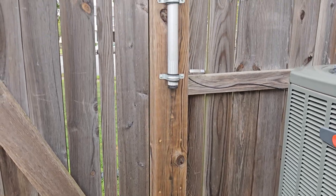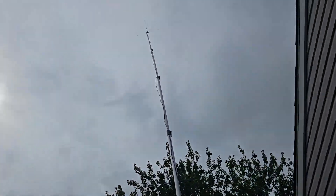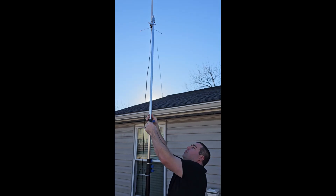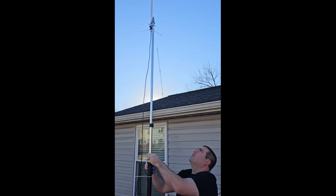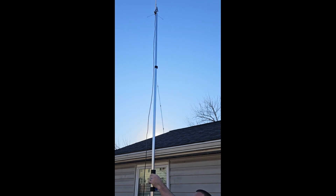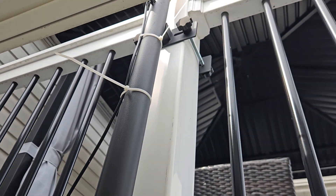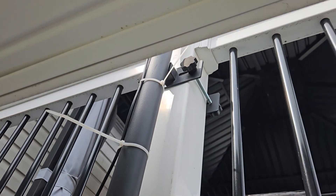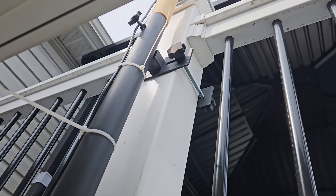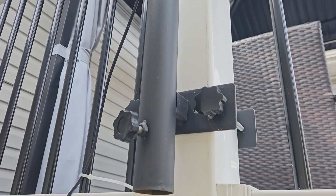One of the last things you're going to need to do is get an antenna high up in the air. We have all this in the Amazon list — these are aluminum push poles anywhere from 19 feet to 33 feet. The one shown here is in a deck umbrella holder, which we'll also list. This is a great way to get an antenna up high and also be able to take it down when bad weather comes through.